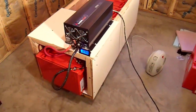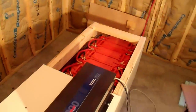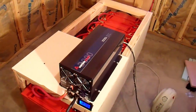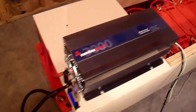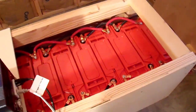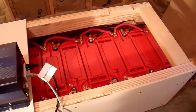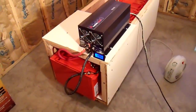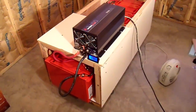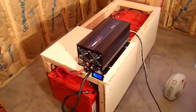And there we go — my inverter-generator setup is working just fine. It outputs around 80 amps continuously, it doesn't get too hot doing it, and it recharges my battery bank as needed. I can fill it with gasoline, start it up, it runs for a few hours until it runs out of fuel, and then I'm just running on batteries again. I've used this setup to run my entire house — I tried it out for a full day just to see how it worked, and I've also used it through one power outage already. This is my 12 volt DC generator actually operating with my battery bank and my inverter. Thanks for watching.